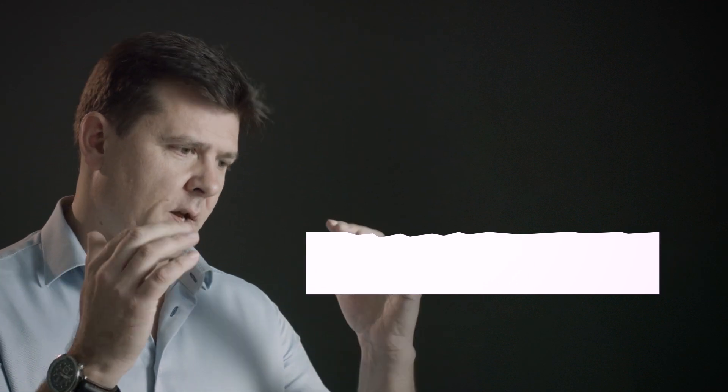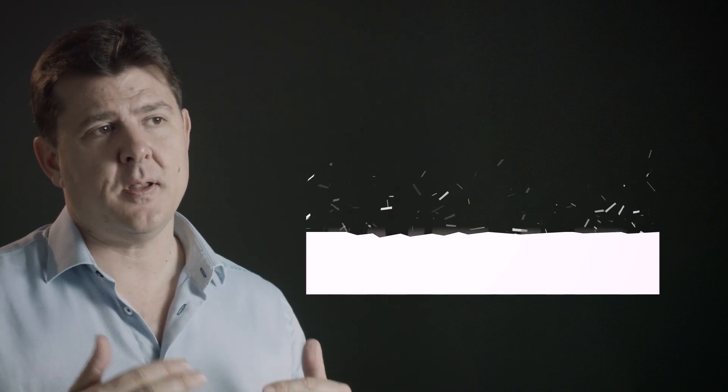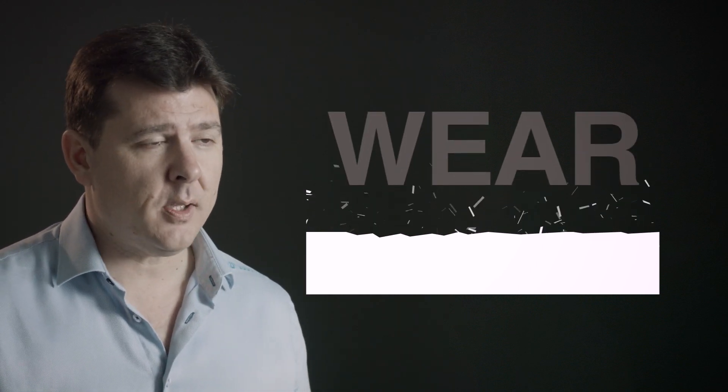So the surface of the material starts to lose its hardness and it starts to be pushed around effectively. And also if it's being softened, then wear comes really quickly as well — these things are often linked together. There are some really cool pictures on screen where you can see plastic deformation and dies that have suffered hot wear as well, and we see this all the time.